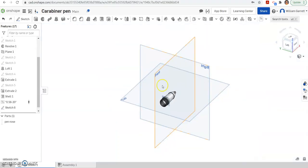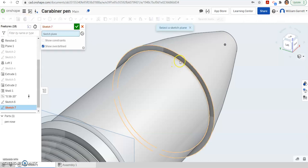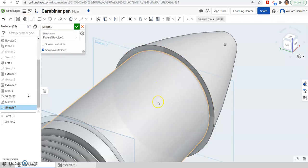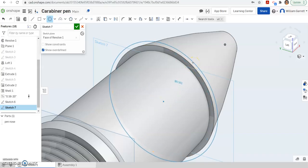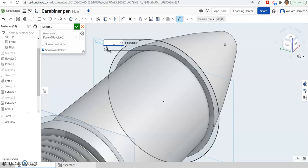Then I'm going to turn my object and do the same thing on this end of the grip. I'm going to hit sketch, click on that circle, and then get a center point circle starting from the middle. You can either go down and get that square center, or rotate it all the way around. I'm just going to go up outside my object so I can then dimension from the inner circle to the outer one and get a distance of 0.05. I'll set that as 0.05 and hit the green check to accept.